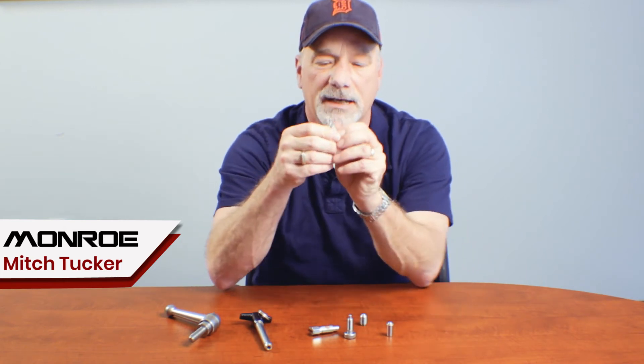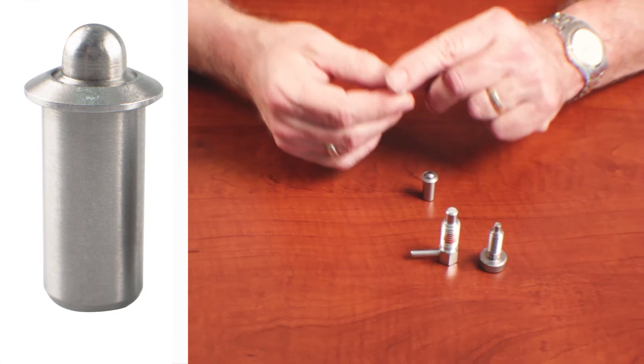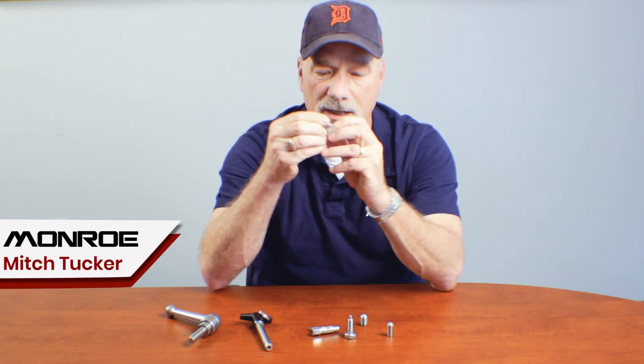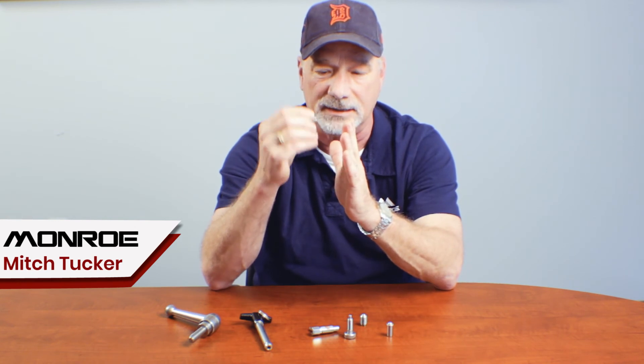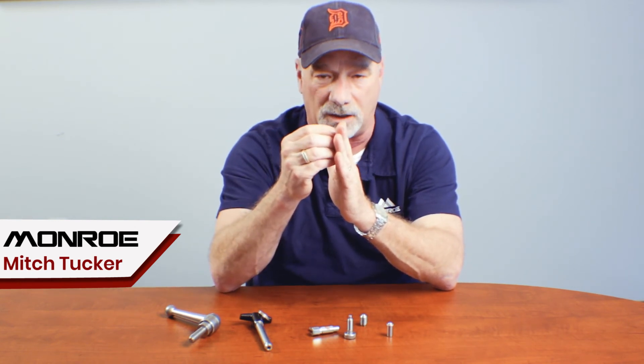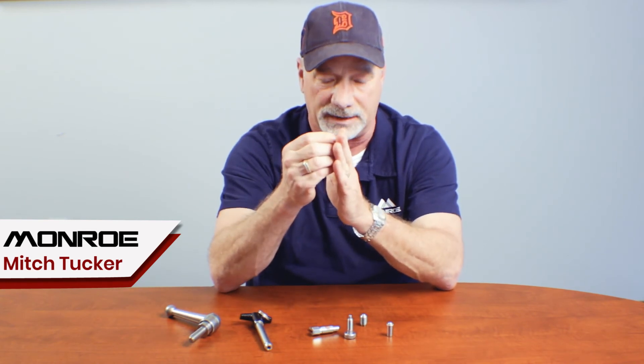The pin style is much steeper — it very positively retains the features that are joined together. Imagine two discs rotating and a hole is in one disc. When this pin enters that hole under spring-load, it very positively retains the two parts together.